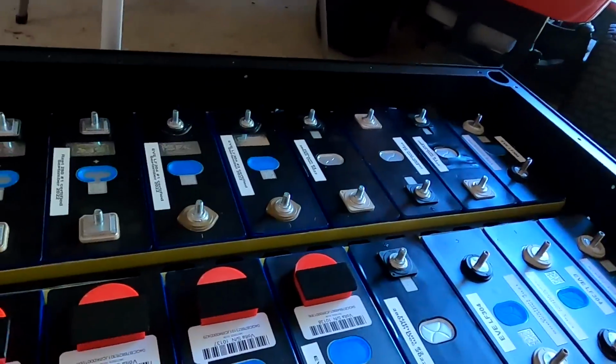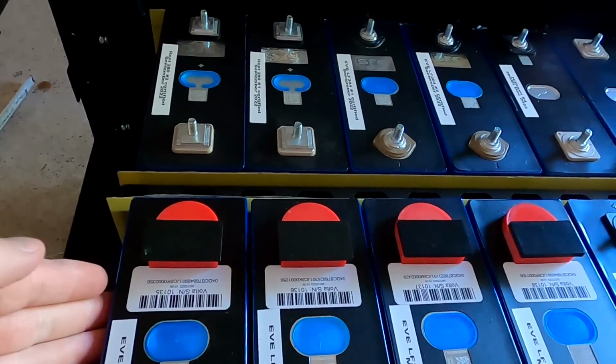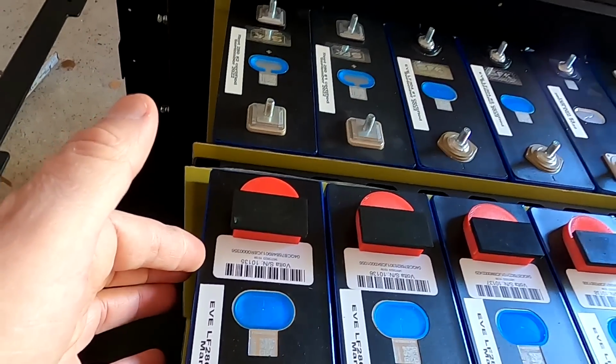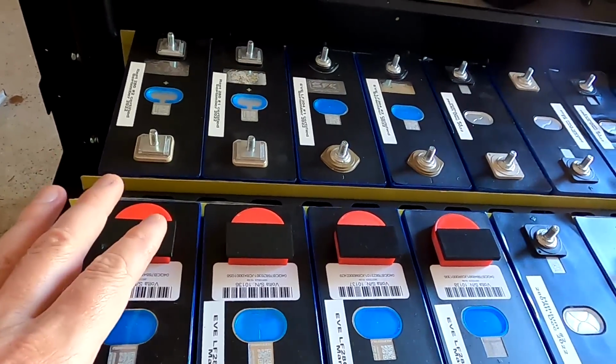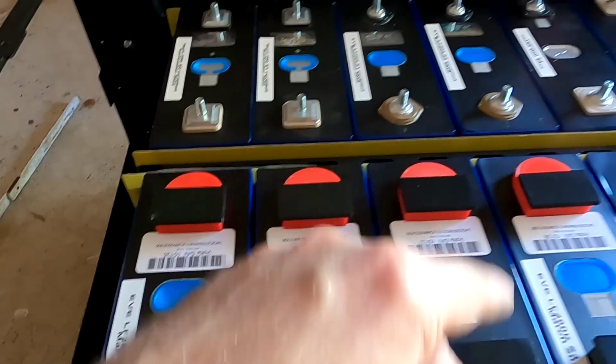So I have the two rows now ready and we have the same width or depth, whatever you want to call it, up to 0.5 millimeter. This is how good I can do it at the moment. It can already make a difference if you just swap two cells in the position, because then the shape of one cell fits exactly into the shape of the other cell, like a puzzle. But if you swap them, they may not fit as good. And I haven't even put them in the right order, so positive, negative needs to alternate.